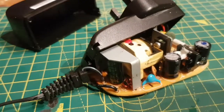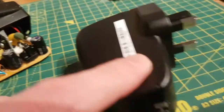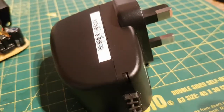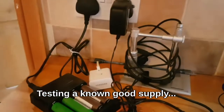That's what it should look like. This is the one I'm repairing — it was putting out 3V, but it should be putting out 12V. It's unregulated so it actually puts out about 14V, which drops when there's a load on it. The working one measures 14.29V.